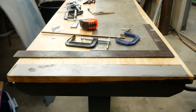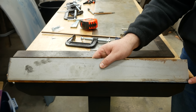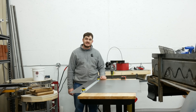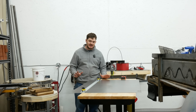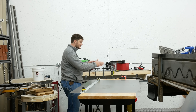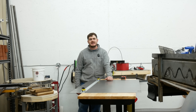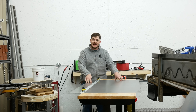It turns out I was cutting this thin steel way too slowly, a fact I corrected about a quarter of the way through this cut. Plasma cuts can be really clean as long as the speed is right. By some almost unfathomable coincidence, the exact size of sheet metal I need to wrap around the bottom and sides of my plasma cut table to make the downdraft table — did I mention I'm making a downdraft table? I'm making a downdraft table — it's exactly the size of this scrap piece of sheet steel I had lying around.